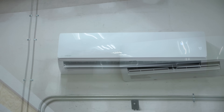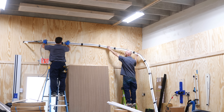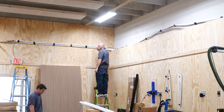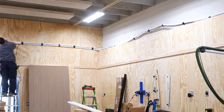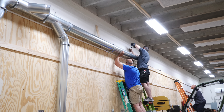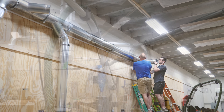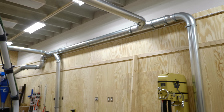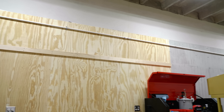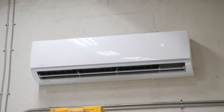With the shop unit finished, we moved on to the unit in the front area. Installing this unit was mostly the same process, except that we needed a much longer line set to reach the back side of the shop. That's why I went with Mr. Cool's Advantage line, because I needed a custom line set length, which they don't offer in the DIY series. The only other big difference was that we used three-quarter inch PVC pipe for the condensate line, which is a little more secure than the included hose and allowed us to run the line over the longer distance. The line drops from left to right, again because condensate lines rely on gravity to run the water outside. With that, both systems were working great and the shop was feeling amazing.